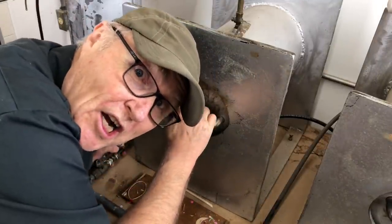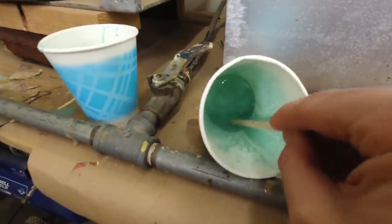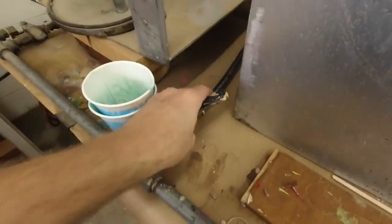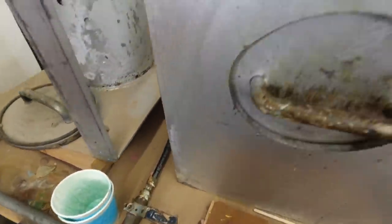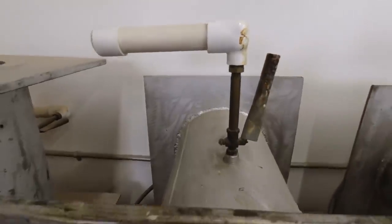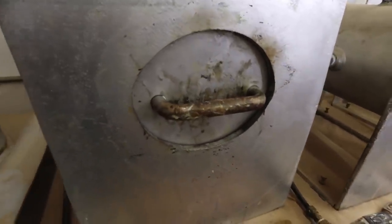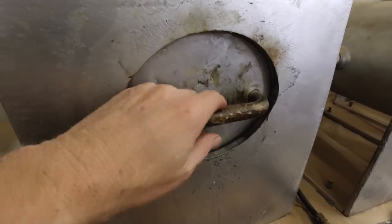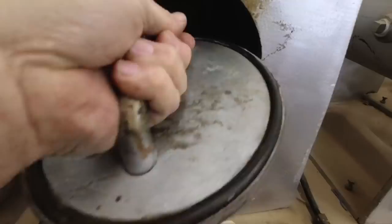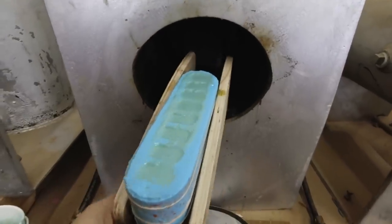The compressor kicked on. Let's see what the old witness cup has to tell us. Hard as a rock — beautiful. Close the inlet valve, that shuts the compressor off from the tank. Let the air out. Once the pressure goes out of the tank we'll be able to open the door — you can't open the door while the pressure is holding it closed, no amount of pushing will do that. There we go. First batch — let's take it over there and pull this thing apart.